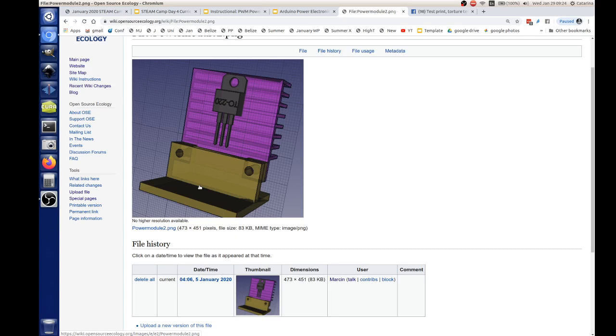Do the same principles apply to essentially a variable speed motor? It depends what kind of motor it is. For a DC motor, yes, you can do that exactly, because it's a DC load. You can go from zero speed to full speed, or anywhere in the middle. So using what we learn here, you'll be able to translate this to electric vehicle controls, for example. And like the cordless drill, it would be the same kind of DC motor.